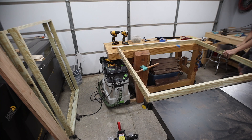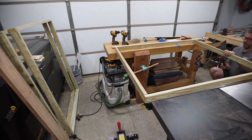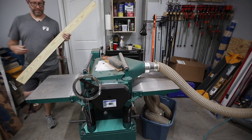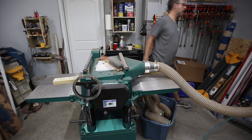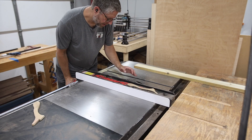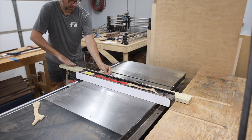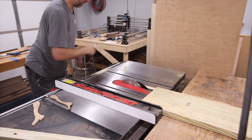Because of that miscalculation, the easiest thing to do was take one of the three frames and cut it in half, basically making two smaller frames. That way I can use the shorter off-cuts of the fence pickets in those small frames. I had to get a little more material out of my scraps and I didn't even have quite enough, so I ended up using pocket screws on one side of one of the small frames, but I was able to do it in a way that they'd be totally hidden.